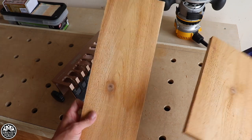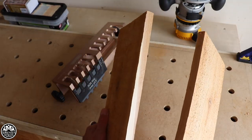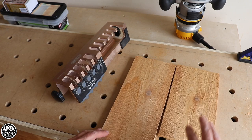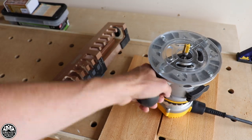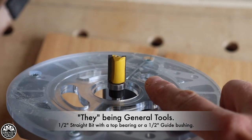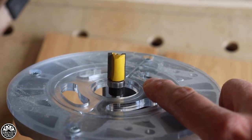The second thing I'm going to use is this rough sawn cedar board. It's approximately half inch thick so we're not going to see a really fine fit and finish on this one, so don't get too excited — we should get an adequate box joint out of this. I'm going to use my DeWalt router. They recommend a half inch top bearing bit, or you can use a half inch straight bit with a half inch guide bushing.